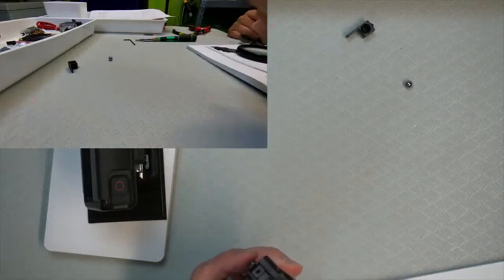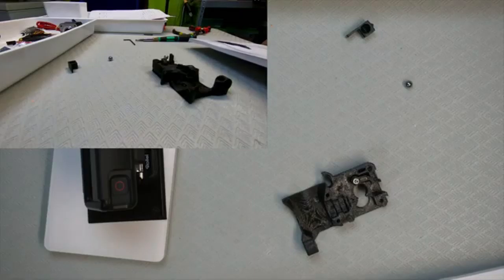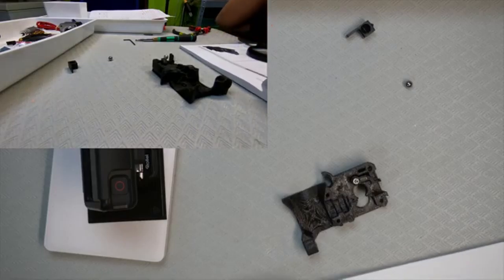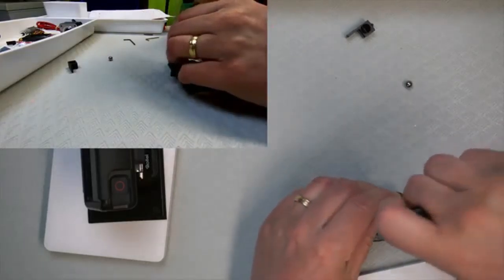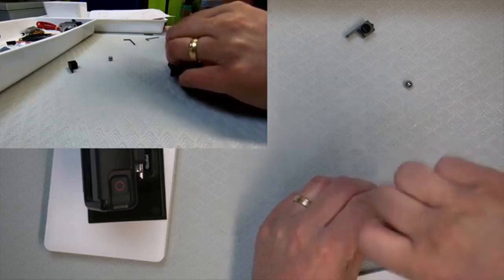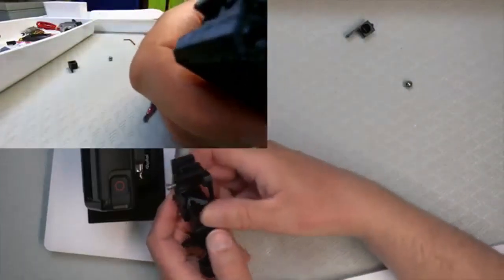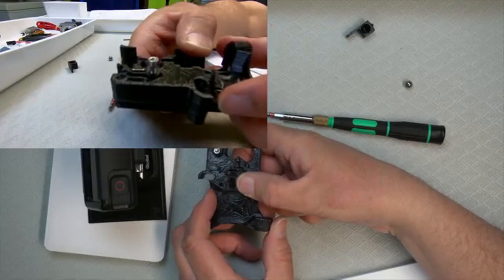Self-tapping screw, I suppose. We'll read it here. FS lever in the body, secure the part with the M3 18 screw, but ensure the lever can move freely. Warning, make sure that the following procedure is done right, otherwise the filament sensor will not work. Insert the bigger magnet in the extruder body, it will stick out. Correct set of magnets. So it's still banging on about this repelling, but it has to be inserted so that it repels. Inserted that way around, and then there's the screw to go in.